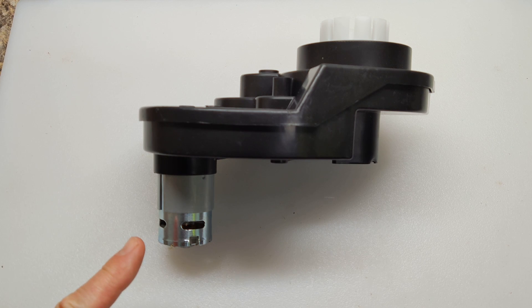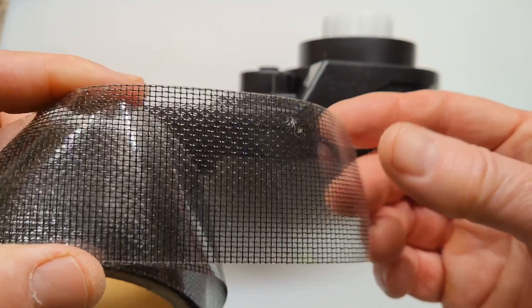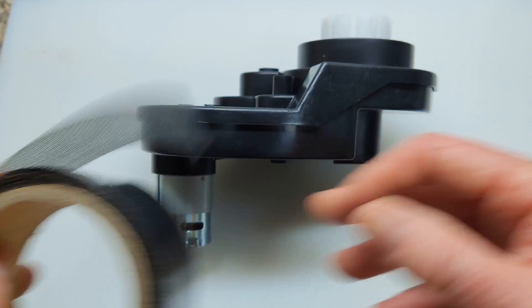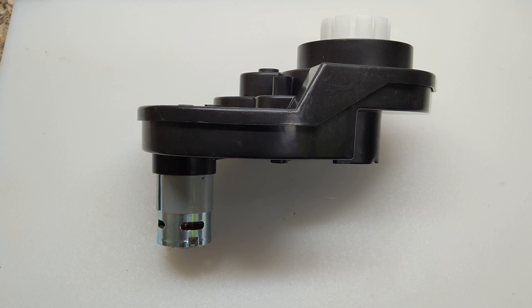I wanted to mention something about the gearbox motor. It has slots because there's a cooling fan inside — when used with a ride-on toy it generates a lot of heat. Because it's going to be used just to momentarily turn the shaft of a trolling motor, I don't anticipate it getting very hot, but I would be concerned if water splashed inside those slots. I don't recommend this for salt water at all. So I'm going to use fiberglass repair tape, which I've used in the past to make vented PWM boxes, and just wrap it around the outside to keep water splashing out while still allowing air to circulate and keep the motor cool.